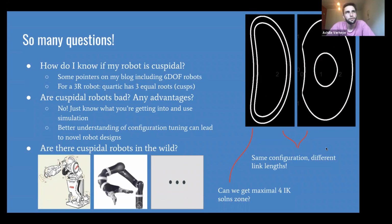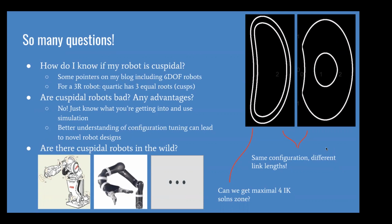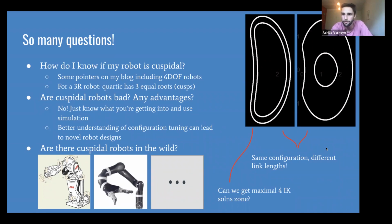Yeah, I can't speak for all of the brands that are out there. There's definitely the whole spectrum of manufacturers using pretty simple stuff to more complicated stuff. But from what I've seen, they mostly use that second approach, which is the Jacobian-based approach for their Cartesian planning. But most of what they do, if you have a robot doing pick and place, a lot of that is just joint space planning. You just know this is where my robot has to be to pick up, and then it needs to drop it off here. You already know those positions in joint space, or you've even taught them by moving the robot around. You just do your interpolation in joint space.